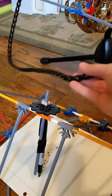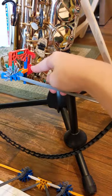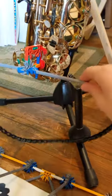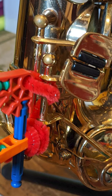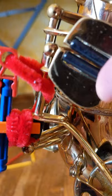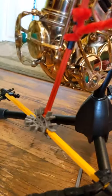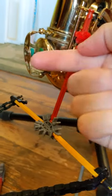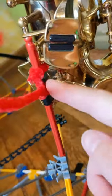There are two problems: the chain is slipping, and this gear is just not turning with the button. I think that's because we don't have a good connection — the lever arm is slipping at the axle. A large problem with this system is that there was no friction between the lever arm and the axle on the saxophone. This was one of the most critical pieces I had to fix. Now we're coming down first and then spreading out, so I'm hoping that will minimize the slippage and reduce the force weighing it down off of the axle arm.